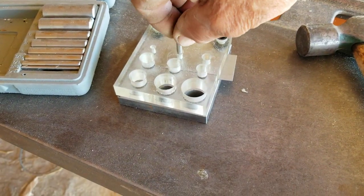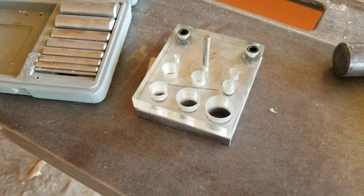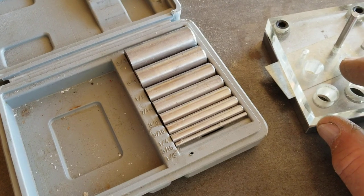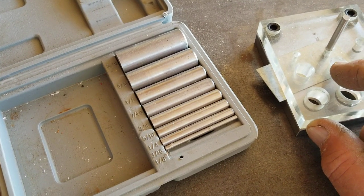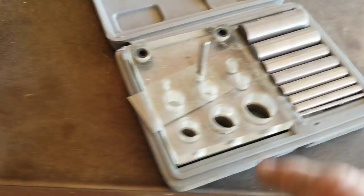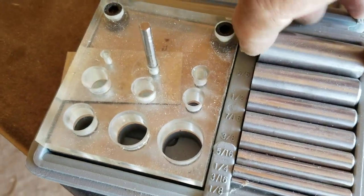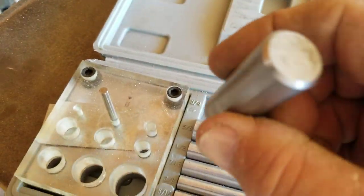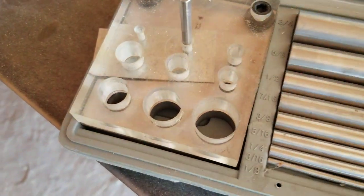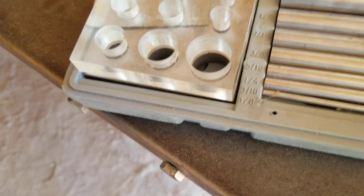As you can see, if this was a drill and it caught on there, that thing would spin at the same speed as your drill press and just slice your hands up. So do not drill sheet metal like that. If you're going to drill sheet metal on a drill press, make sure you have a good way of clamping it down, like between two pieces of wood or something like that. That's my little Harbor Freight tool — I've had this for years and I love it. It goes all the way up to a three-quarter inch hole, and it works on paper, cardboard — anything that will fit in between the plastic plate and the aluminum plate at the bottom, you can punch a hole through with this.